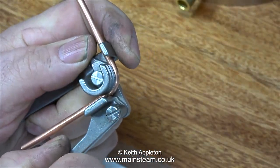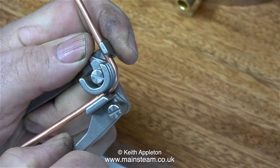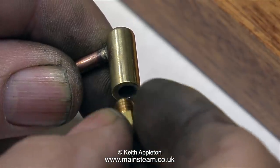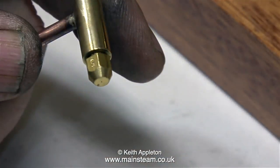And here I'm bending the pipe using the excellent Microcosm pipe bender. This next part of the operation is very important. Once you've silver soldered the gas jet holder to the pipe, I recommend blowing through the pipe and gas jet holder with some compressed air. This gets rid of any particles of metal and loose scales from the silver soldering process that may remain in the pipe, because these gas jets are very easily blocked.